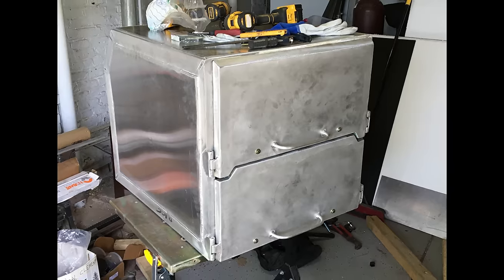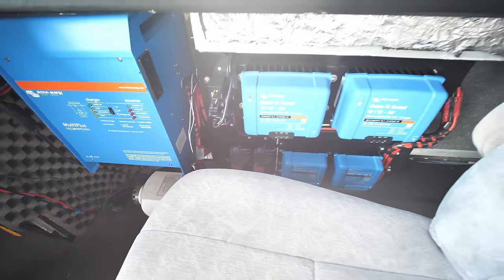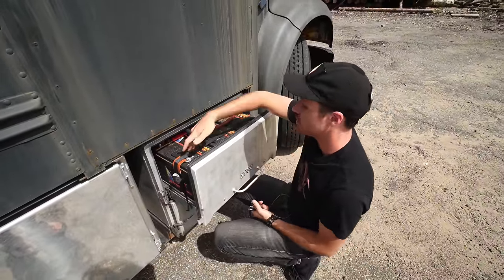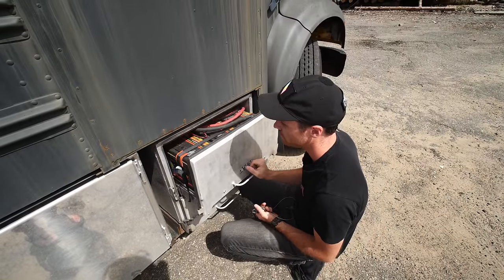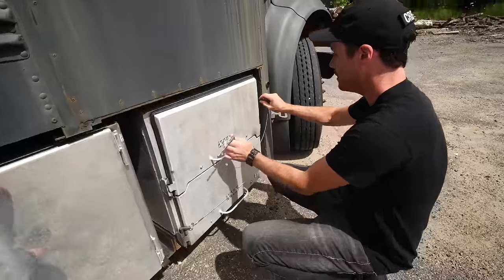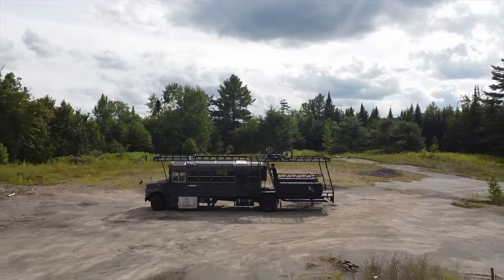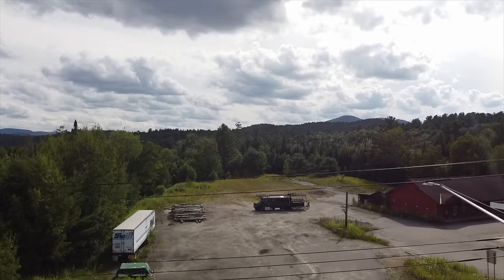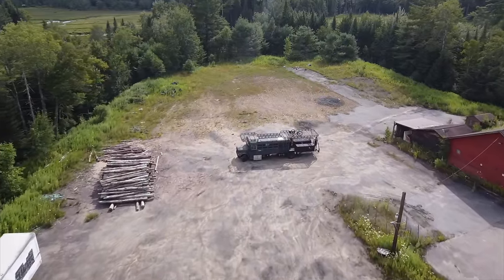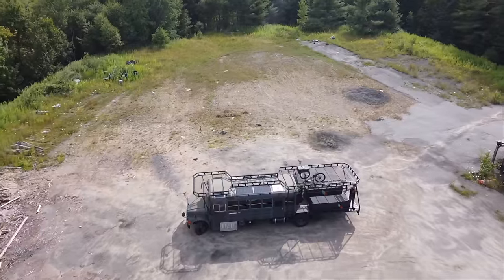This is my battery box. Right inside this wall is where all my Victron system and distribution equipment lives, so having the batteries right here makes the wiring really simple. This is two drawers of six batteries each — three starter batteries and three AGM gel hybrid house batteries in one drawer, and six more house batteries in the other. I went with gel hybrids because temperature requirements made me uncomfortable going with lithium — this build sits unattended and unheated in the winter for long periods, and it needs to charge and discharge during that time. I didn't trust lithium to manage itself in those cold months, so I went with gel for now and maybe I'll go lithium in the future.